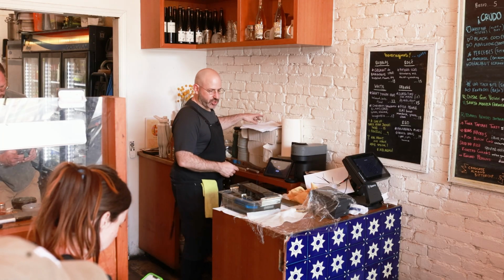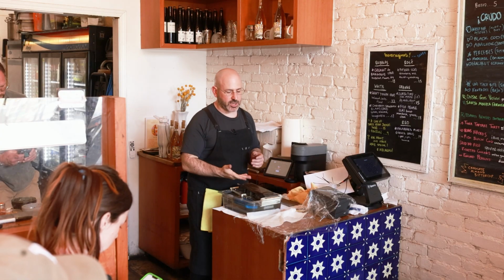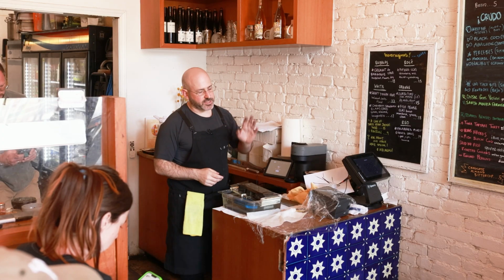When you are applying pressure in sharpening, your hands each have different roles. So for example, your right hand is going to be responsible for angles. We talked about the angle of approach and the angle of sharpening. All of that's going to occur in this hand, all right? Your left hand is going to be responsible for pressure and ideally movement.